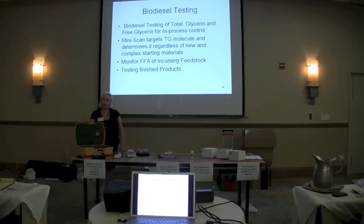You only need to recalibrate once every 30 days, and you're really just taking known materials that have a certain amount of total glycerin or a certain amount of FFA, and checking that the instrument gives you the correct slope you use for determining your samples. Are calibration standards provided or do you acquire them separately? They're in the kit.